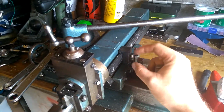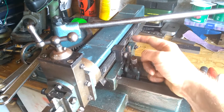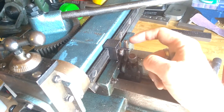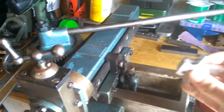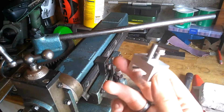As I said that time, the only bit that was missing and the only thing that didn't work was there should be two of these blocks — one more that goes on this side — and these little levers attached to the block should hit against this bigger lever, which advanced the ratcheting auto-feed mechanism. So I needed to make one up, so I have.